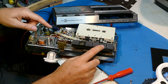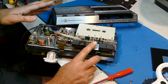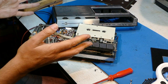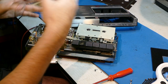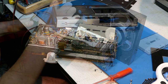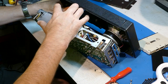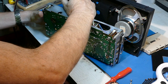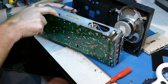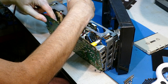So we've got the cassette in here. Fast forward just seems to shut the motor off — well, the amplifier off. Start shuts the amplifier off. Stop does what you'd expect. And rewind shuts the amplifier off, and the motor for some reason is no longer spinning. So the switch is back to front, and the motor's only working when it feels like it. Let's switch the supply off. Which is the play button — third one along, which is start. Because it wouldn't be labelled play because it's Grundig. There's an adjustment here for the actuator on that switch, but something's not quite right. So we need to understand how this switch works. So when you press play, this lever releases this switch.